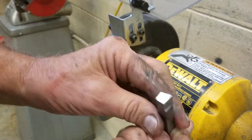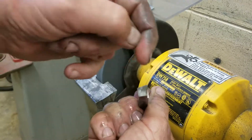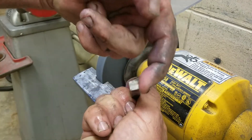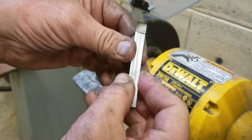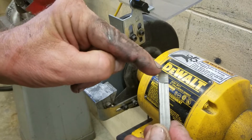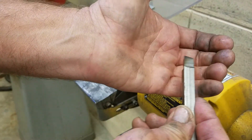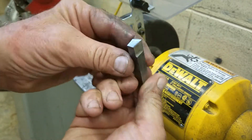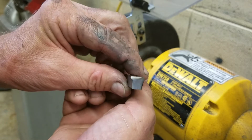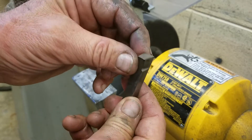Here's our final product. You can see on the front we have all of our angles — there's our cutting edge. We want to come away this way, this way, this way, this way, and on the top we're coming off that way and that way. It's a right-hand tool coming from the right, moving from the tail stock to the head stock. Some people may put more angles on them, like 12 to 14 degrees, and that's fine, but 10 to 12 degrees works absolutely fine.